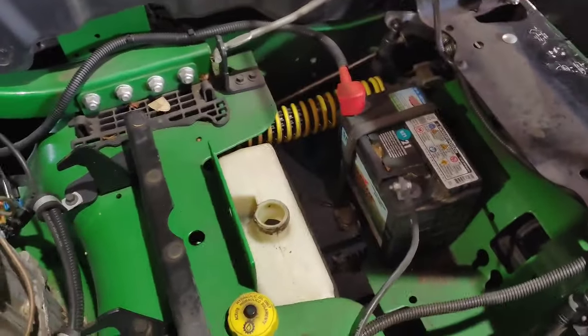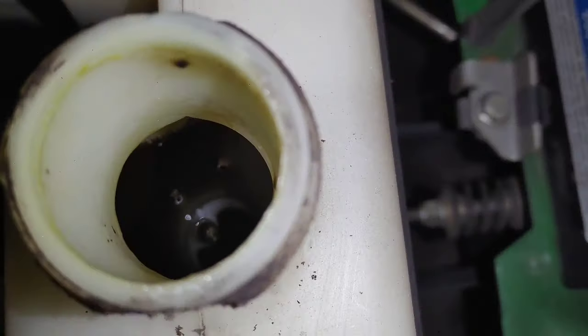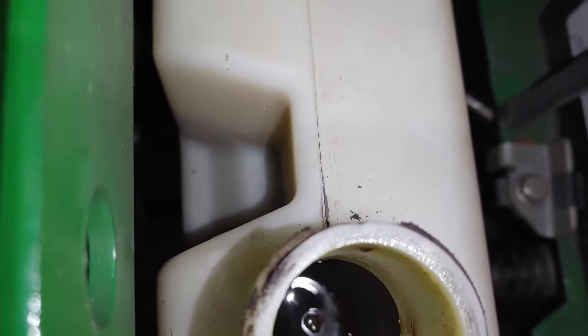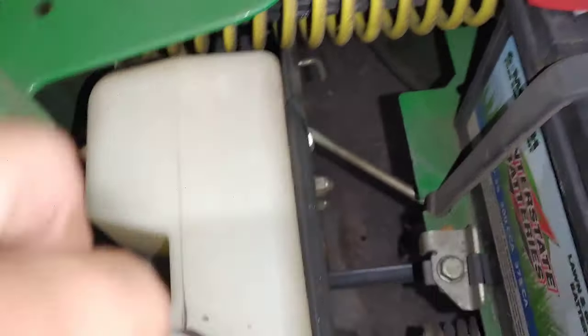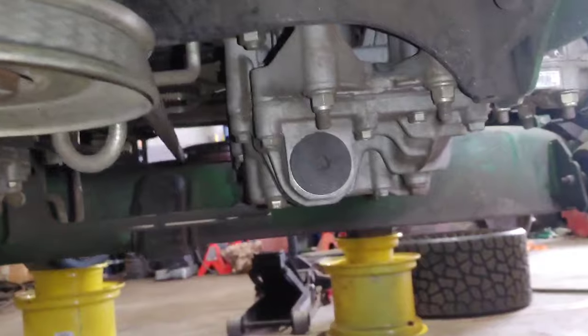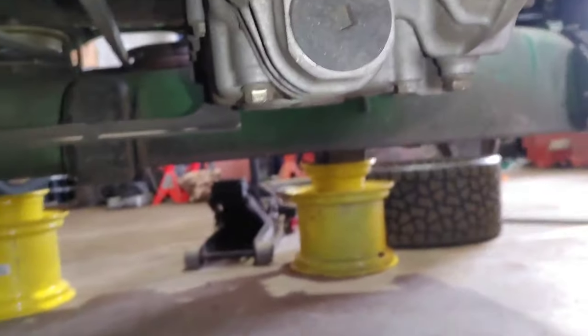In the past I've gotten lucky a few times just by changing the oil — sometimes water gets into the hydro oil, sometimes there's air that gets in from the oil level getting too low or operating at a real steep angle. I'm sticking a napkin down in there just to check the color of the oil. It actually looked really good and the oil level was correct. So my next step was to drain the oil. Notice that axle shaft seal with stuff wrapped all around it — you want to keep your eye on that, you don't want it to leak.